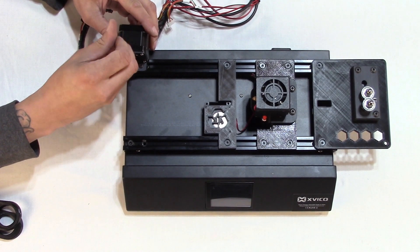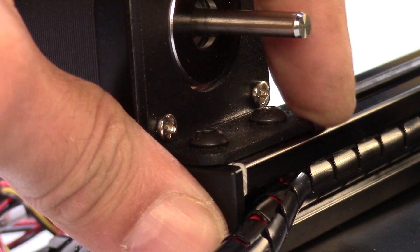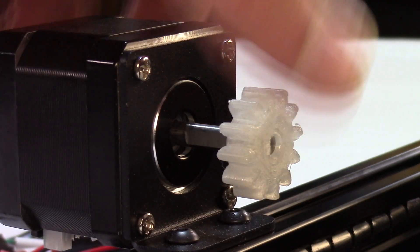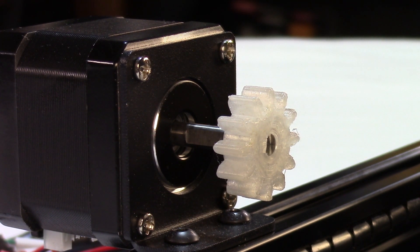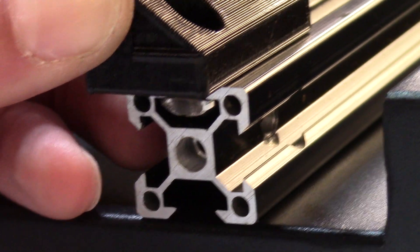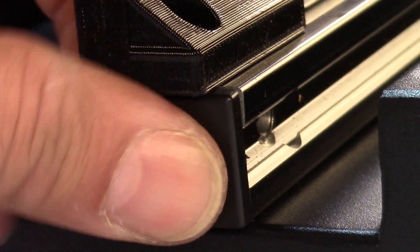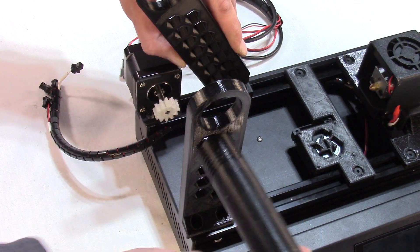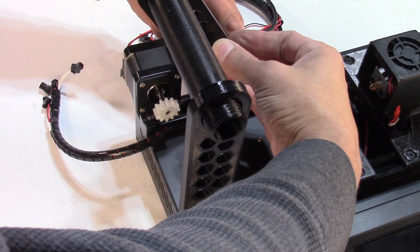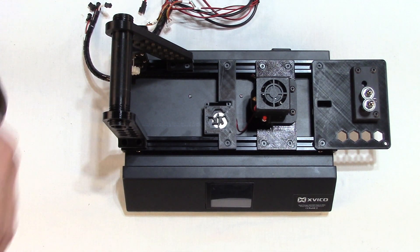Step 12B: Single or Dual Motor Build. MK3 Lite Single Motor Build: remove the 2020 end caps on the right side of the rails. Attach the extruder motor on the back rail on the outer edge, making sure the T-nut is set flush so that the end cap can easily snap back in place. Place Recreator 3D Part 8 small gear wider onto the motor shaft using size 2 hex tool. On the front 2020 rail, set Recreator 3D Part 5A spool holder in place on the outer edge, making sure the T-nut is set flush so the end cap can easily snap back into place. Using Recreator 3D Part 5B spool holder light single on the back 2020 rail, set the two screws and T-nuts in place about 2.5 inches from the edge, using size 2 hex tool.